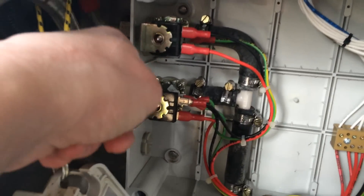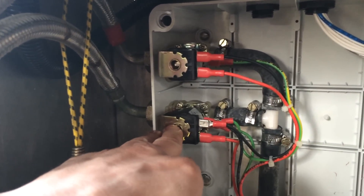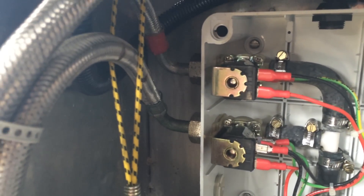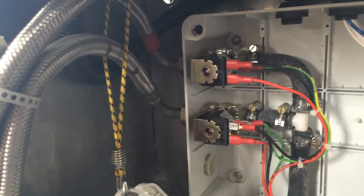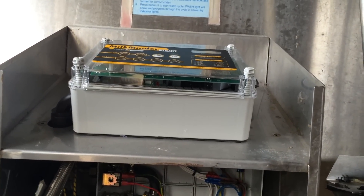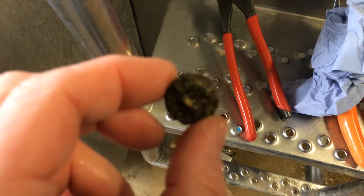We've checked the hot and cold are around the right way — that when it's asking for hot, it's getting hot, and the same with the cold. But there's hardly any cold water coming in, so we're going to take the nut off here. There's a filter behind there — we'll check that; it might be full of scale and stuff. It's probably not been checked for a year. I think we cleaned it out when we put the tank in. So we'll check that as well, then put the cover on and get the sticker done. That's the cold water filter — we'll give that a clean, and we'll check the hot water on as well since we're all in the attic.